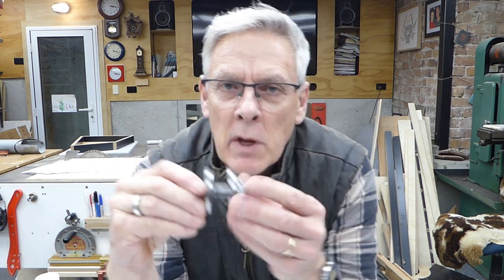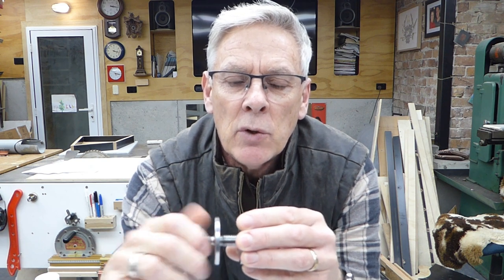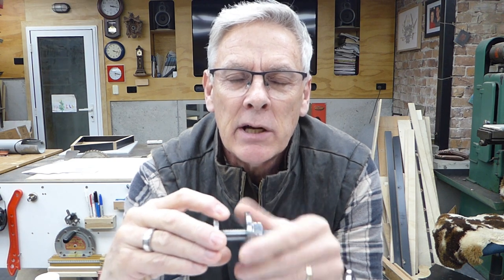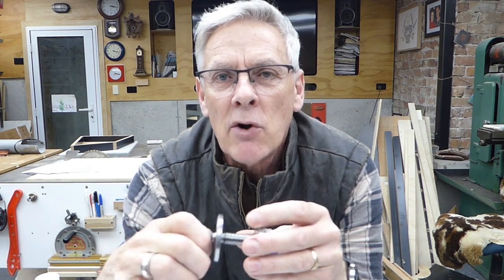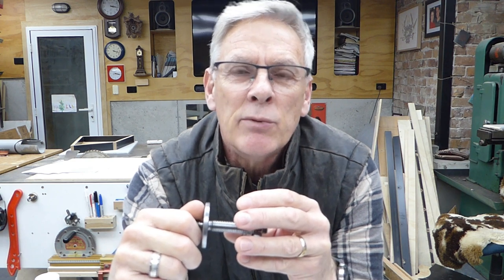Well, here's the finished article. That was a lot of work for such a small little spindle. Would I do it again? Not sure. Used a lot of material, and a lot more than it should have because of the way I crashed it. The plus was that I got to use my new lathe and turning a left-hand thread, single pointing it, and that was great fun.